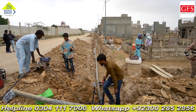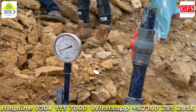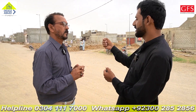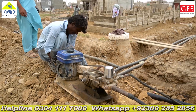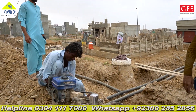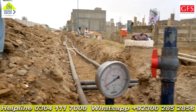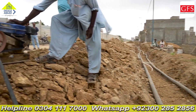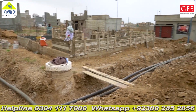When the pressure test is run with valves closed, we isolate the line — we only leave the pipe up to the gate. The pipe is then attached at the gate and the pressure is closed. The purpose of this is to confirm that the water supply is perfect and there is no leakage.